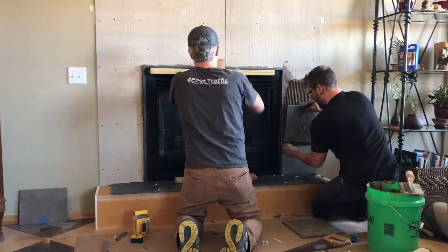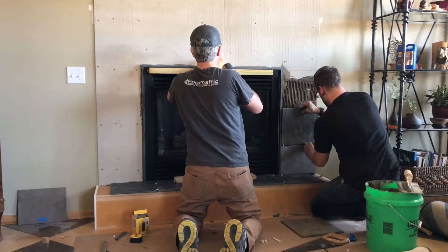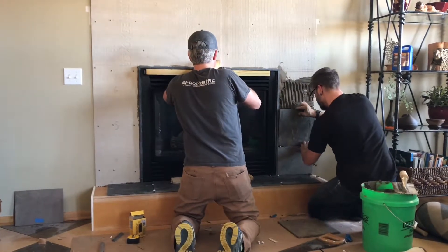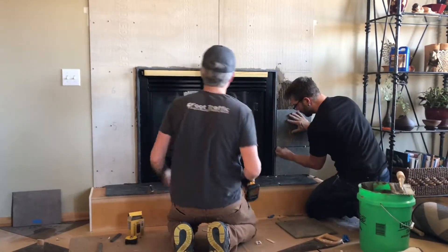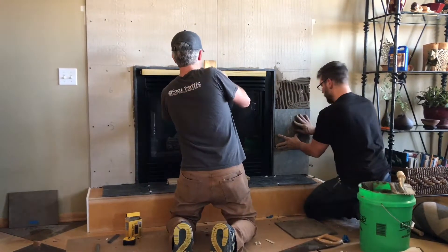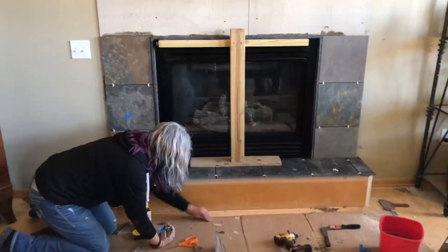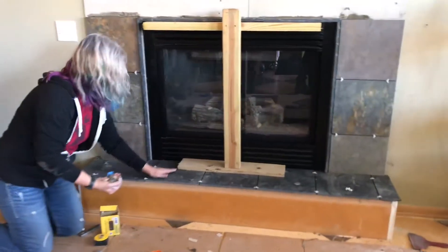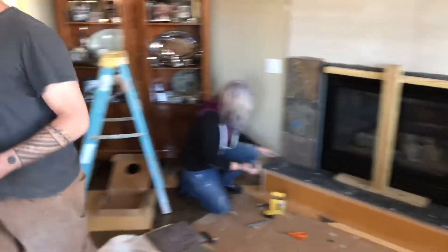For the rest of this video the audio didn't turn out quite so well, so I'm just going to talk about what you're looking at in the background. I'm setting tile here, and the reason we go from the bottom up on a vertical surface is simply because of the weight — each tile kind of pushes down, and you get your spacers in there. As you can see with the little white spacers, everything just sits on top of all the other pieces.